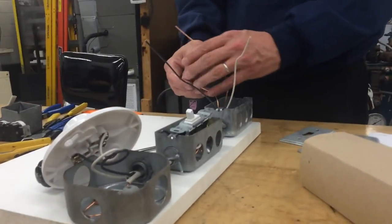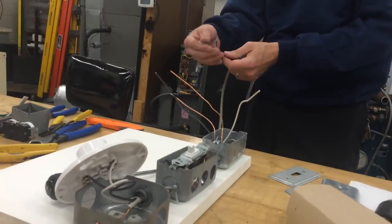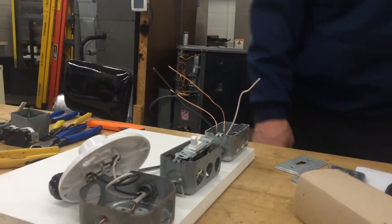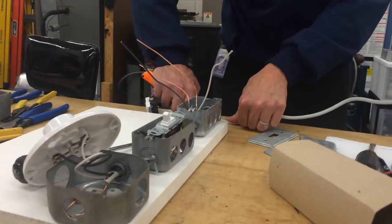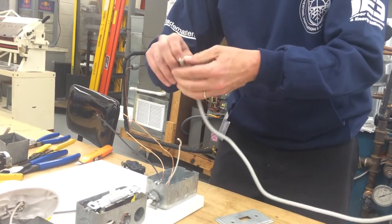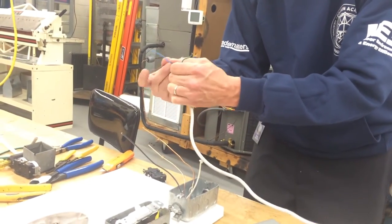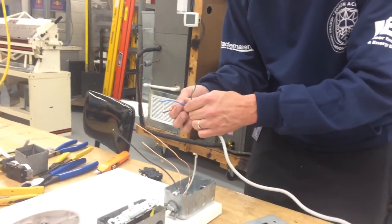Now for the outlet — I'm going to have grounds here and here, need another pigtail, and also have a ground for the power cord coming in here. Some power cord wires are black and white so you know which goes to silver and which to brass. But not every cord is black and white — some are computer cords. When I strip back the insulation I expect to see black, white, and green. But look — I've got a green, so that's ground. But I've got a brown one — is that close to black, or is the blue one black? How can I figure out which way the plug is supposed to be wired?